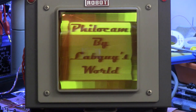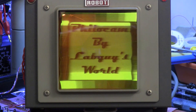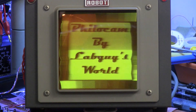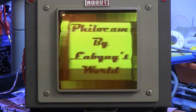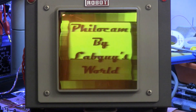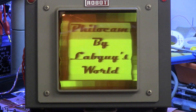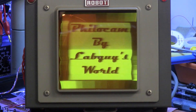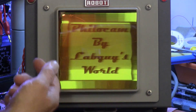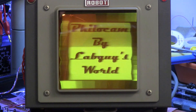This monitor operates at 267 lines, 15 frames per second. That's the standard that I designed the PhiloCam sync generator to operate in. After I turned the deflection yoke, the other change I had to make to get it to work correctly with my board was to reverse the connections of the horizontal direction of deflection because I had a mirror image. No problem — no biggie at all.